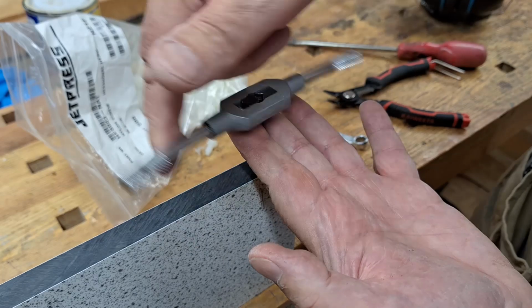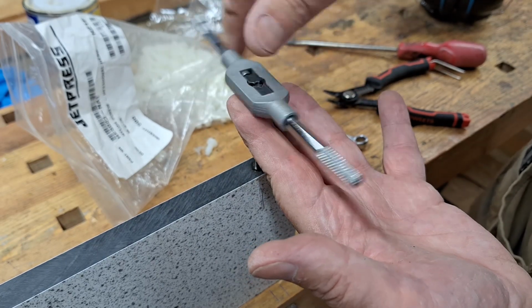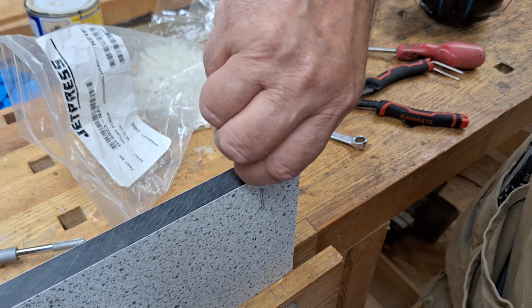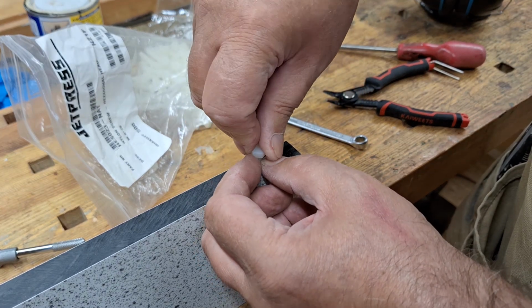These nylon bolts allow the jig to slide sweetly over the cast iron table, and they also allow me to set the jig square to the table. As you will see later, I had to redo these holes because I hadn't got enough adjustment to square it up.